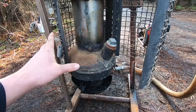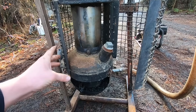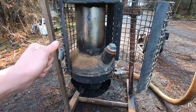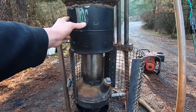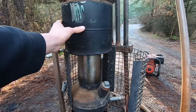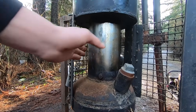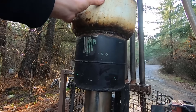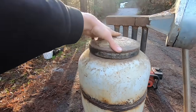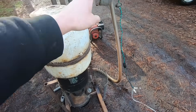With this being around a four and three-quarter inch fire tube, I'll be able to run about a 20 to 25 horsepower engine, which should more than power most home generators. After the flame tube, all we need is to store fuel that can be fed by gravity into the shaker grate. I've got this half a freon can with some sheet metal to seal it up, and I welded a five-gallon propane tank on top and added a simple lid.